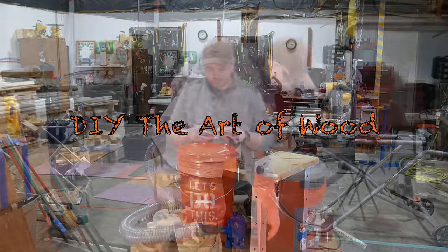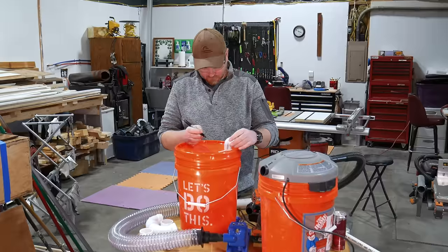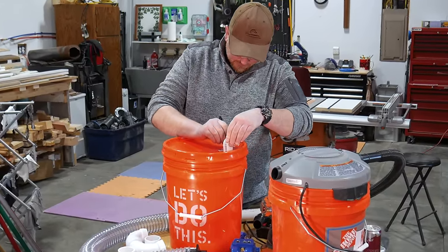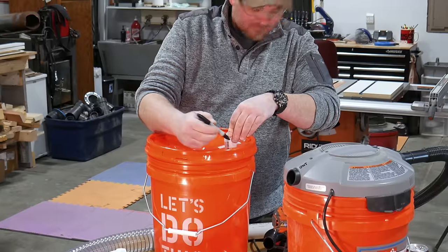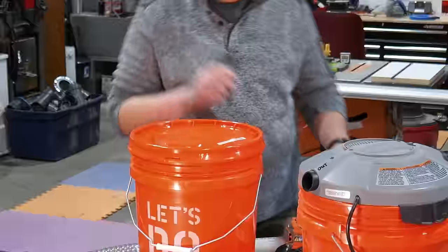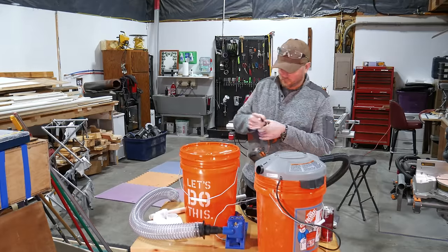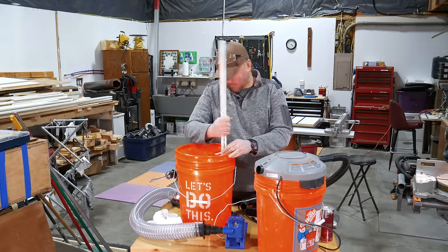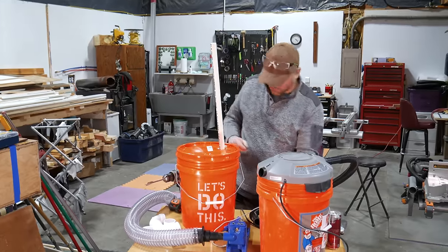The first thing we need to do is make the dust collection chamber, and a five gallon bucket with a tight fitting lid will do just fine. The first piece to install on the collection chamber is the vacuum hose inlet port. The vacuum hose on my shop vac has a very small diameter. Here I'm using a three quarter inch PVC 90 degree elbow, but you may need to use a different size pipe and fittings depending on your shop vac. Once you determine the location of the inlet port on the lid, drill a hole slightly smaller than the diameter of the PVC pipe to create a snug fit. The plastic lid should stretch enough to fit, creating a relatively tight seal before we even get to the stage of adding silicone to make an airtight seal.